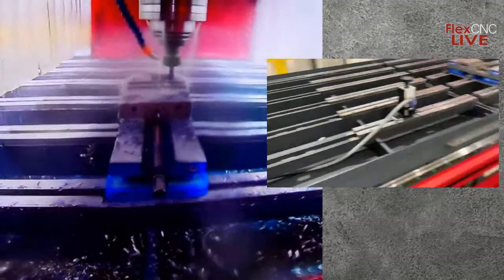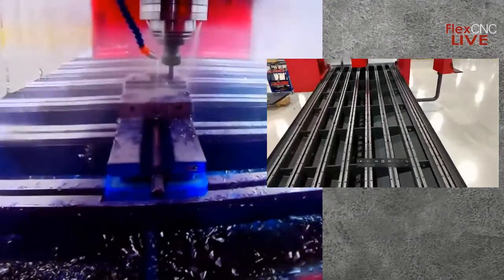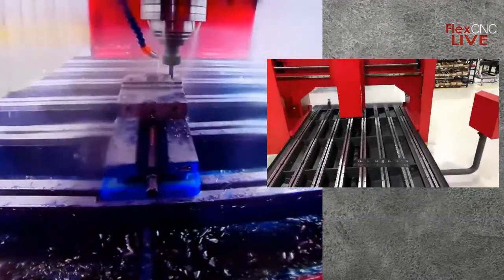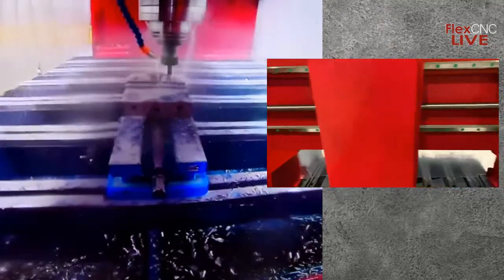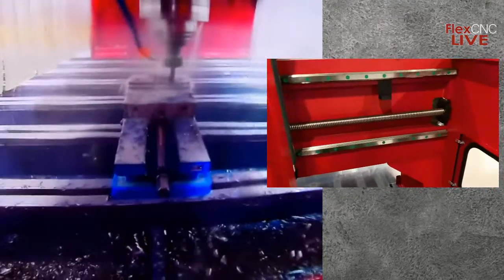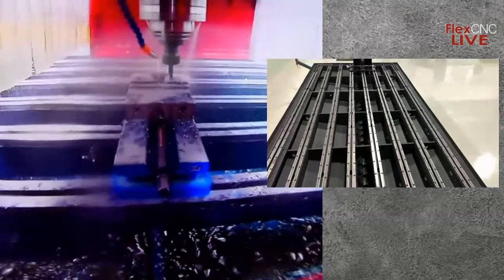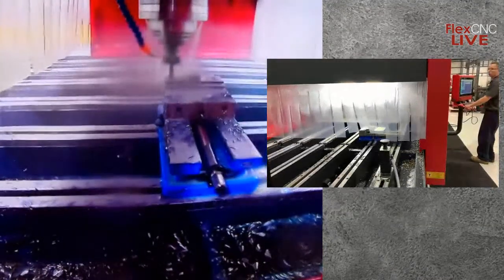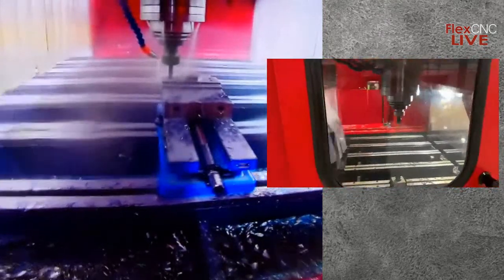There's a tool touch off, the tool calibrator. You may have seen a cord hanging down from the top of the machine. That's just for our GoPro here, so your machine wouldn't have that. But there's a good look at the auger as well. As you can see, the chips will fall through and the auger will push it. On the Y-axis and Z-axis, it moves using a ball screw, and on the X-axis, it uses a helical rack and pinion.